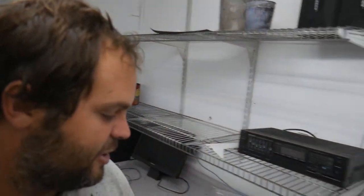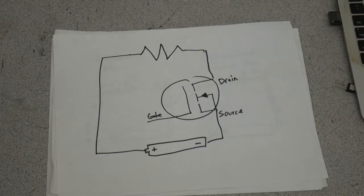The problem with that kind of transistor is when you have very, very high power devices, much like this power inverter, where you've got thousands of watts, you know, if you've got a 100 to 1 ratio transistor, you still end up with a significant amount of power to power your transistor. And of course, in today's electronics, the smaller the drive power and stuff is better. So that's where the metal oxide field effect transistor comes in, the MOSFET.